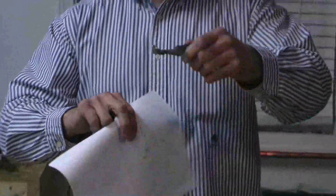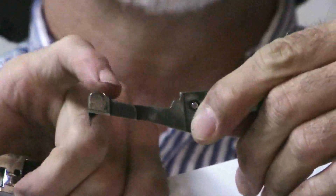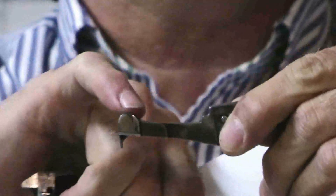On your carrier, this is where I've cut mine. I've come out to where your normal flat spot was and I've totally removed the hump that's in these carriers, bringing it down probably about a quarter of an inch or thereabouts. I've angled it up and stopped my angle at the backside of the wings. It's okay to go a little into the wings, but watch when you're working this into your rifle. If you go too far, your round will flatten out too quick. If you leave a hump there, it'll angle up too high and hit the top edge of your chamber.